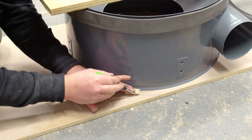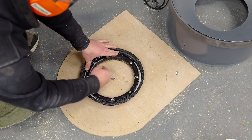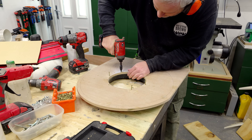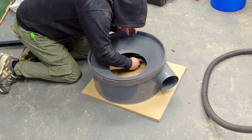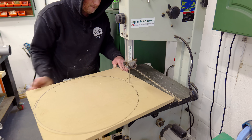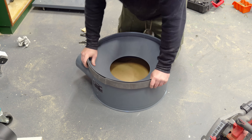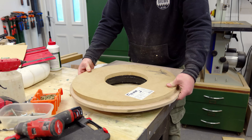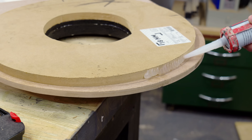This piece of MDF is what this component is going to sit on and I want to leave some space around it, so I'm scribing a line using a domino. I centre my barrel lid onto the MDF, draw around the hole, get that cut out too, and mount the two pieces together. Then I want to shape another piece of MDF to sit inside to help seal things up and make it airtight. This was tricky because this component of the extractor isn't very rigid - it's a little bit flimsy so it's not always a perfect circle, and shaping something to fit inside it snugly took quite a lot of time. That piece then gets the same hole cut out in it too and then I can secure it to the top face of this shelf. Then I add loads of silicone - I want a really thick bead to hold it in place both inside and out.